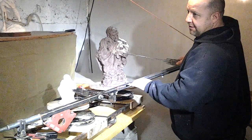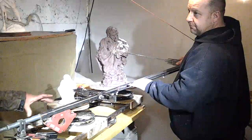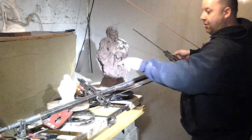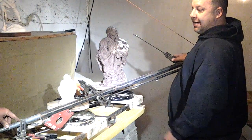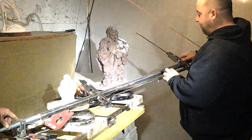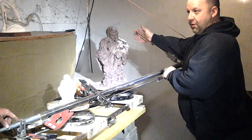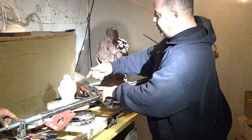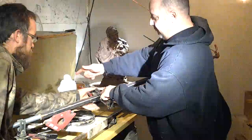I calculated the height of that to the height that I wanted it to be and it worked out to be 2.59, so I went 2.6 because I don't mind it being a little bit bigger. What you do is you take the distance from here to this pivot point and you divide it by 2.6, and that gives you your distance from here to here. The same thing from this pivot point to the end of your pointer - divide it by 2.6 or whatever ratio you're going to, and that becomes the distance from this pivot point to here.